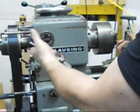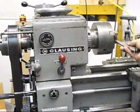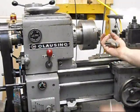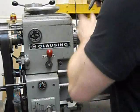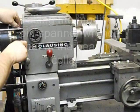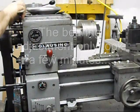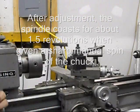The two bearings, actually — there are two tapered roller bearings in this headstock. So that's the way that I went about tightening up the preload on these bearings: just putting a wrench in the jaws of the three-jaw chuck and torquing it. Once I got it torqued up, I'm just going to have to pop the set knob so we can take this out and rotate it around until we get our Allen set screw lined up and re-tighten that locking set screw. So, very simple procedure. This is Lucas signing off.